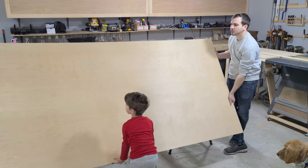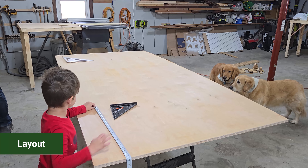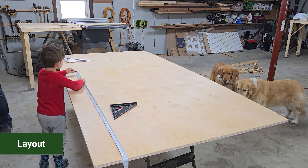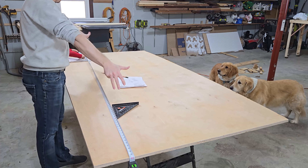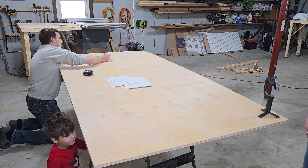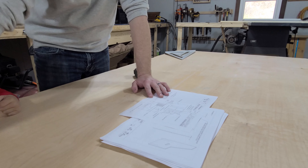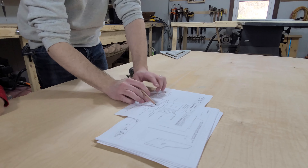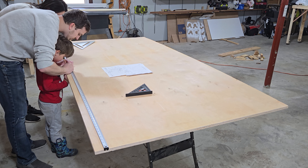For a project like a workbench, a cheap sheet of sanded plywood would work great. We actually chose one with a birch veneer — we wanted a prettier finish, and it came back to bite us in the end. The veneer layer was very thin, with more defects than we originally noticed. We did our best to work around these defects, but the bigger issue was how poorly the layers were laid. There were bumps and voids, and the glue had separated in many spots.